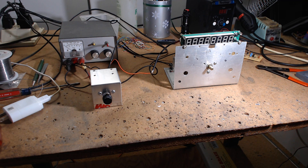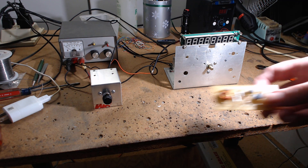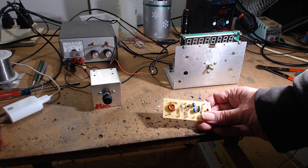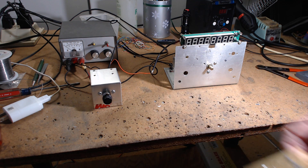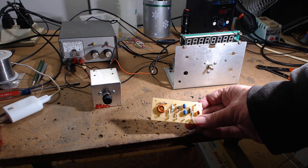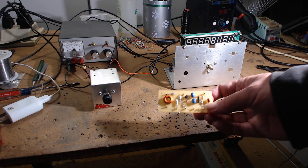One day I saw a Franklin oscillator circuit while building something else and thought it seemed really stable. I hooked it up to the direct conversion unit and it worked — stayed really solid. I couldn't believe how much difference there was in drift. This Colpitts board is loaded up with polystyrene capacitors instead of NPOs, which are supposed to be better, but it does not work right with a huff and puff.